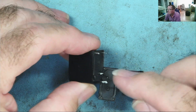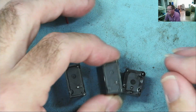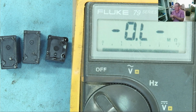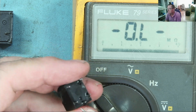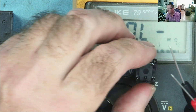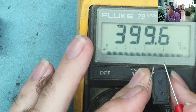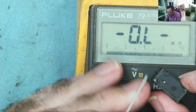We should also check the coil resistance compared to the one that's burnt up, because if the coil resistance is much lower, the switching transistor will be passing more current. If it's the same or higher, I don't think that would cause a problem. I'm on the ohms range - measuring the bad one first, the coil should be across these two terminals. The bad one reads 239 ohms. The good one reads a bit higher, so that's fine - it means the switching transistor will be drawing a bit less current. We can use either of those.